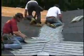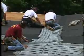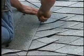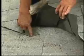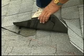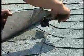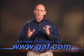Next, apply shingles to the unshingled side. Make sure that the shingles extend past the center line of the valley so that they can be trimmed properly in the next step. Trim the shingles as you install them using a chalk line to ensure a neat installation. Crop 1 inch on a 45-degree angle from the upper corner of each end shingle as you install. This will direct any water back into the valley. Finally, embed each end shingle in a strip of asphalt plastic roofing cement 3 inches wide. For more details on specialized valleys like the California Valley, see the GAF ELK website.